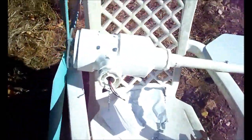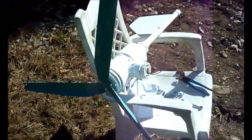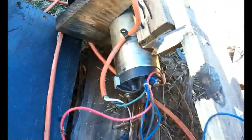I took our windmill tower down and got a new windmill to put up, very much all out of PVC. I hope the blades will last about maybe three years at the most because the sun will rot the PVC — that's the downside of using PVC blades. Here's the old one. I tore the box out, getting the pipe out of it. The motor was out of a treadmill and it would only spin fast enough to produce about one and a half volts, and one and a half volts is not going to do very well charging batteries.